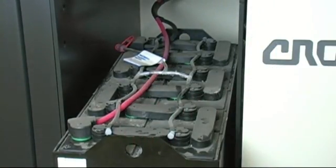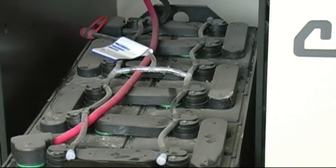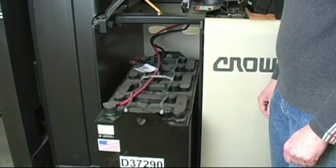Now we begin the visual inspection of the battery. The first thing we do is to look for signs of spillage and corrosion. Carefully inspect the top of the battery and clean it off if necessary with a proper chemical formula that will dissolve the corrosion, and you can rinse all the traces away. Now we can check the various components.